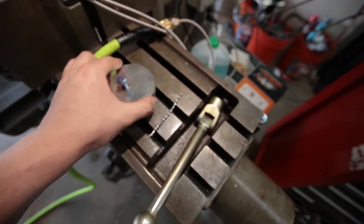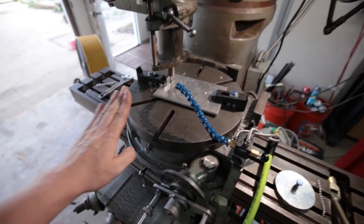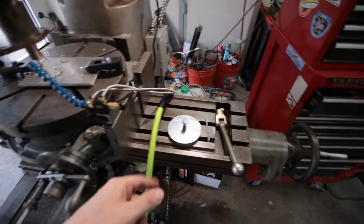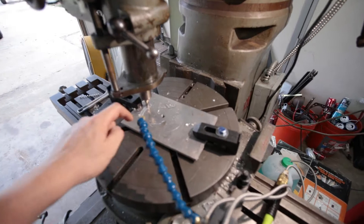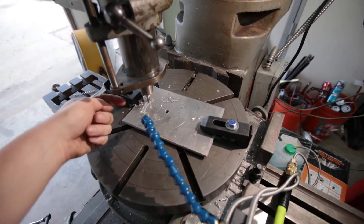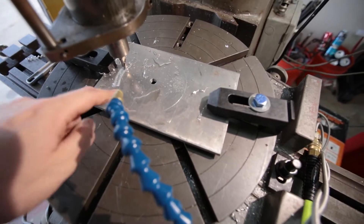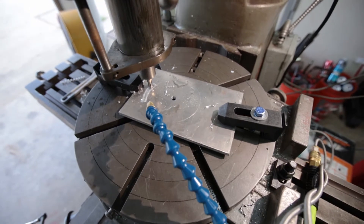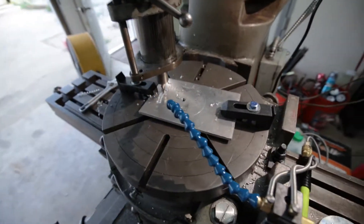So I got to make two rollers here. I got my turntable — I know this is overkill — I got my turntable here on top of my mill. Basically, I just put a piece of quarter-inch aluminum up here, centered my piece here on the chuck, drilled the hole, cranked it over to the scribed line here, which is just the outside edge of that.